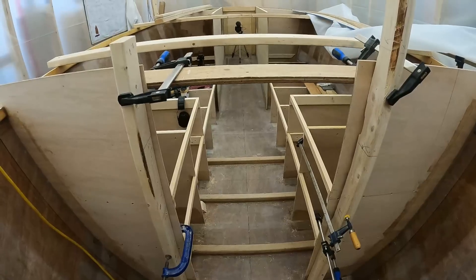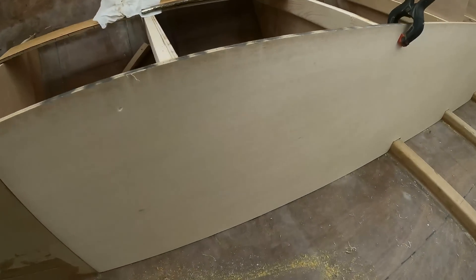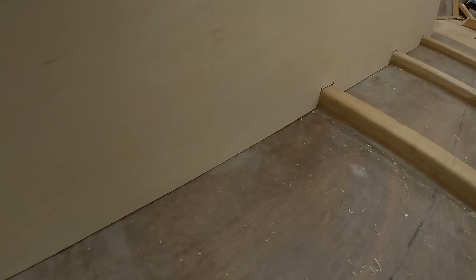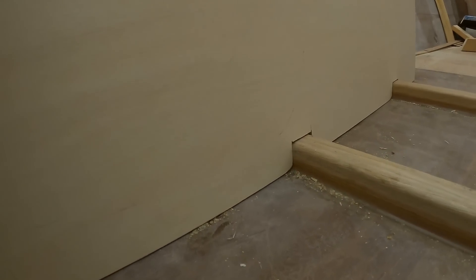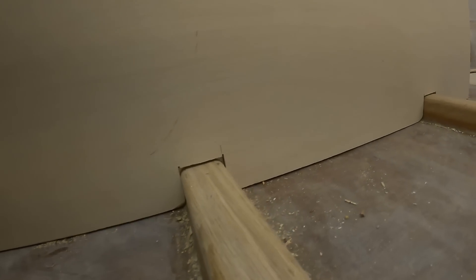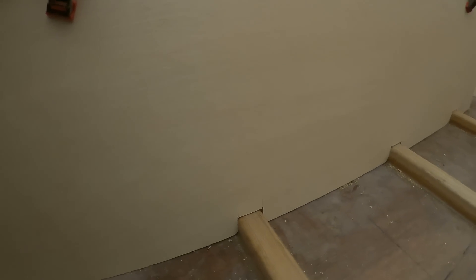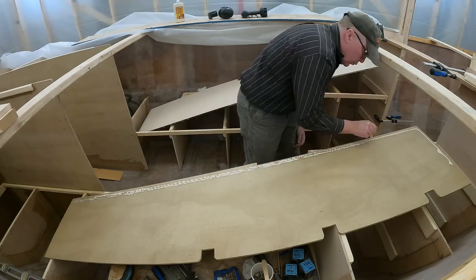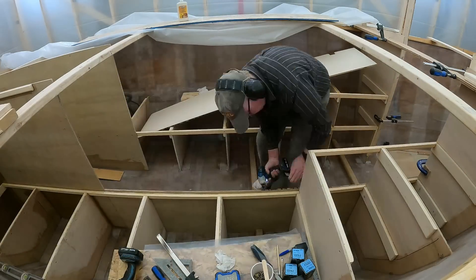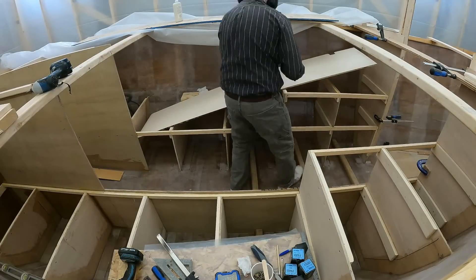Everything's braced, prepped, and we're ready to crack on with the longitudinals. We're looking really good here. Let me show you what the scribed line looks like. It doesn't have to be perfect — we want that little bit of space. We have approximately an eighth of an inch, a little bit more around the oak beams, and we'll use that space to squeeze epoxy in, and the fillet will cover it, and then glass. That way the bottom end grain of the ply won't come in contact with any water — it'll be fully sealed. I've done a cold fit with the longitudinals, put them in place, made sure they fitted, and then pre-drilled and screwed them. Now I've backed out those screws, I'm applying the glue — which is Titebond III — and putting them in place as a permanent fixture.